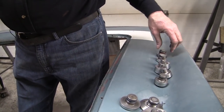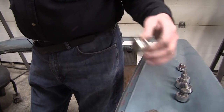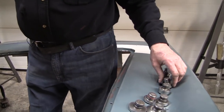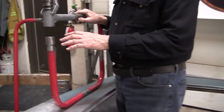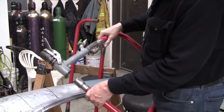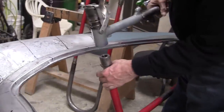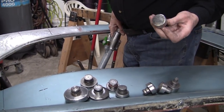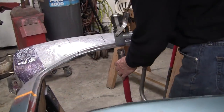And then we have this one here, which has got big 90-degree squared edges. And this one has rounded edges but a much smaller hitting area. And then we've got the complement of bottom dies. This is a great tool, but you need a specific circumstance for that to work. Now this one doesn't have any adjustment — you have to basically spring the frame. So you've got to put it in like this, maybe put the bottom die on. In this case we wouldn't want a flat die — we'd want a die maybe like that to just have a little bit of crown to it. And then you can set that in like this.